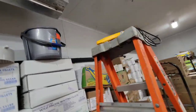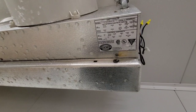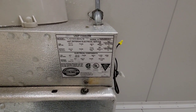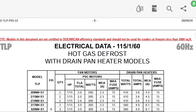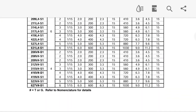We're going to come over to this tag before we go back to our specs. We're going to look at this defrost heater — you see how it has 1190 watts? That's how many watts it is. So we're going to look up that defrost heater. In the manual: hot gas defrost with drain pan heaters — you see how it has this graph right there.